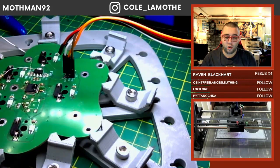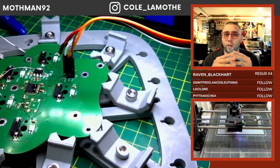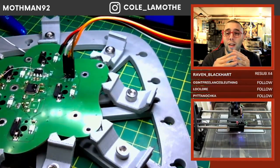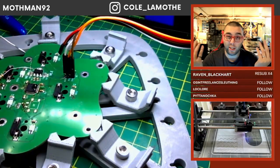3D model the thing with your material thickness — especially if you're going to do boxes you tend to use finger joints or bolt joints or anything like that, where your material thickness makes a big difference. If you've got a quarter-inch thick material and your fingers only overlap by an eighth of an inch, then obviously you're going to have a problem.